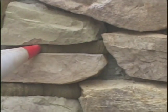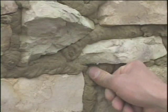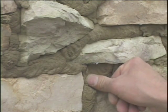It's important that the mortar be applied without air pockets and filled completely to the substrate. After grouting the joints, check to see if your mortar is ready before striking. The normal wait time is about 30 to 60 minutes.